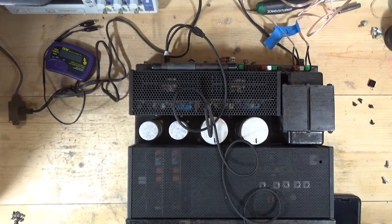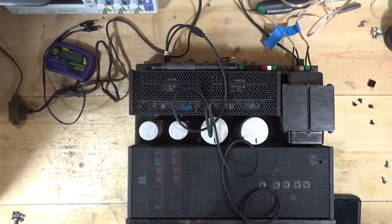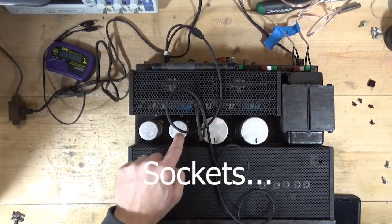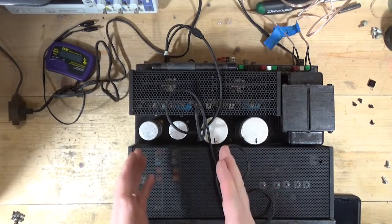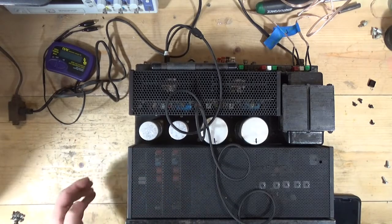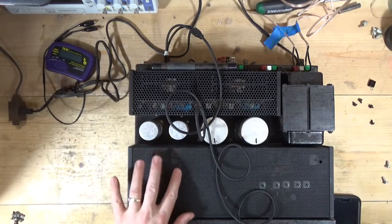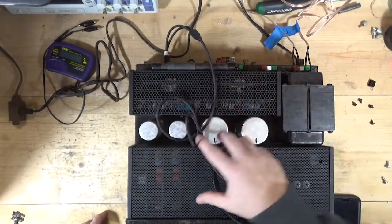So sometimes, because these boards are removable, they just sit in grooves. Those grooves, the board will get a little bit loose in there, and if you tap it, you can get the sound. So basically I had both channels a minute ago, and there's some popping going on, so I bet with as much corrosion as this has, these boards, those contacts need to be cleaned.